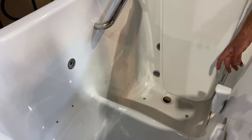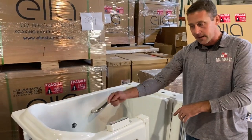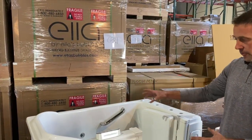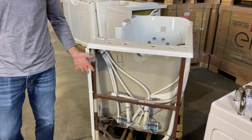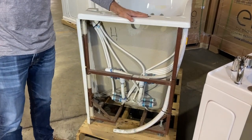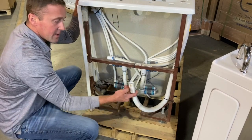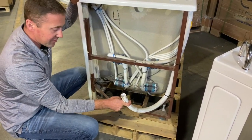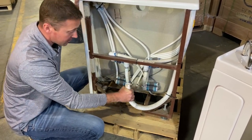Now, the first issue with this is once your water gets below the intake, you need to turn your power drain off. But while the water's draining, what's going to actually end up happening? So what actually happens when you're running the power drain on tub number 1 that they're very proud of, the water's going to pump into this hose under pressure, 1 speed, that's it. The motor only knows on and off. So you turn it on, it's pumping and it's pumping hard.